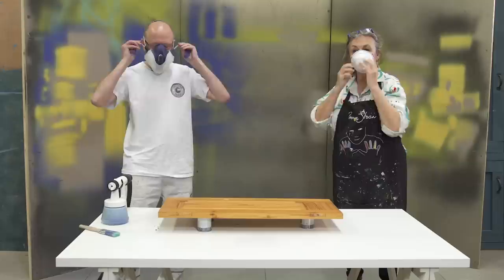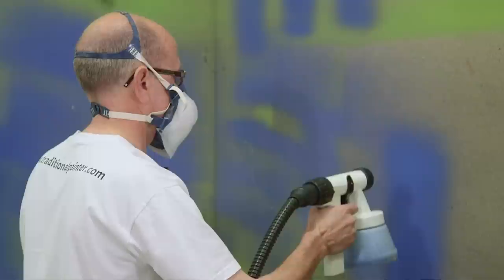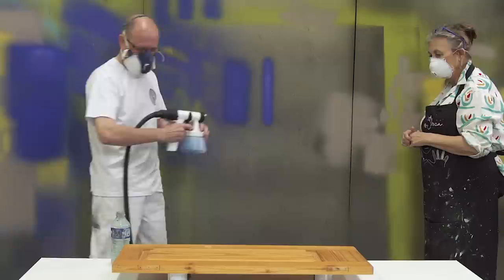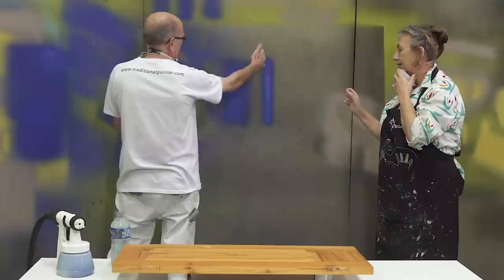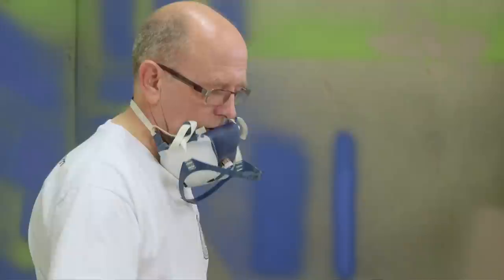I'm putting mine on too — it's a good look! So that's a long cylinder of spray — fabulous, that really looks fantastic. Beautiful, really smooth. That just shows the two widths — that's the thinnest we can go, and that's as wide as we can go. Now let's go and do the cabinet. When we're spraying, we want to get a line of paint down and then overlap it 50%, which means we aim the horns of the gun at the last line so everything gets two coats. If we just spray in straight lines you'll get misses along the edges.